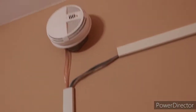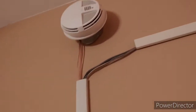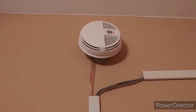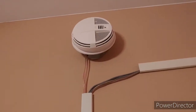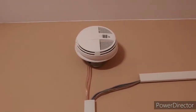Now, we do have expansions. If we follow this wire mold up, we get to a GE449CST. This is the new smoke detector on the system. It looks a lot like a smoke alarm, but it actually wires as a smoke detector — a four-wire smoke detector. That's wired in as device three on this monitoring module. We will be testing that today with a blow dryer. It has a heat and a photo sensor, along with a magnet test that never seems to work, or always takes forever if it does.